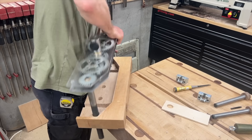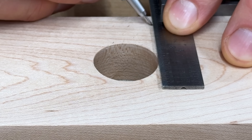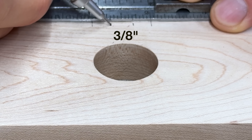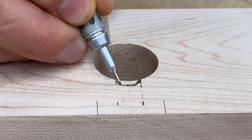And together it goes. Fast forward seven months to today — the bearings have arrived, I start shipping, and I get feedback that my instructions on installing that rail to the jaw were just a little bit light. So I put together some clips to give more detailed instructions. I use a square to mark the edges of the hole for the vise screw at the bottom of the jaw, then center a 3-1/8 inch space for the material I'll remove, and bring those marks back up to the hole. I mark the material to remove and get to chopping.